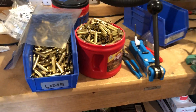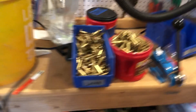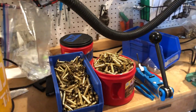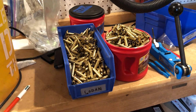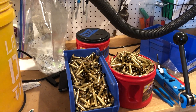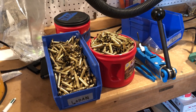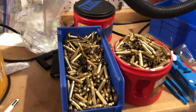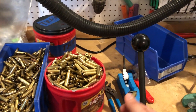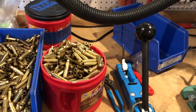From there we go into swaging while it's still dirty. The thing is, .223 and 5.56 brass all goes together — I've bought civilian .223 RAM-stamped ammo from a non-military store and it had a crimped primer pocket. So I made the decision to just swage everything. I'm using the Dillon Super Swage 600 — pretty good machine, fast and it doesn't make a mess. That way I don't have to inspect every case to see if it has a crimp; I just swage everything.